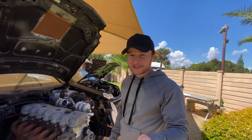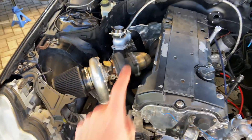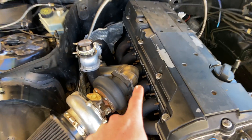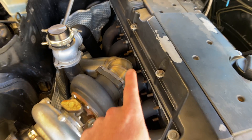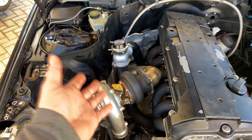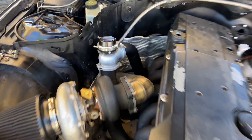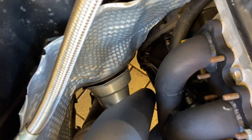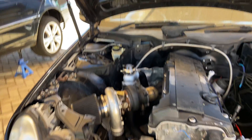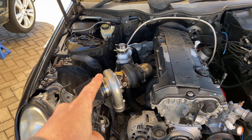That's legit and should be a big improvement. As you saw, I got the down pipe done. The first part is stainless steel and then the second part is mild steel because it's a bit close to the valve cover — a bit too close for comfort given the heat in that area. I did also paint everything to keep it from rusting for now, but that won't last very long because of all the heat. I also got the screamer pipe knocked out, so that just goes straight down to the ground and makes all the cool noises. The more I look at it, that wastegate might be sitting a bit too high — definitely not a perfect setup, but way better than it was before.